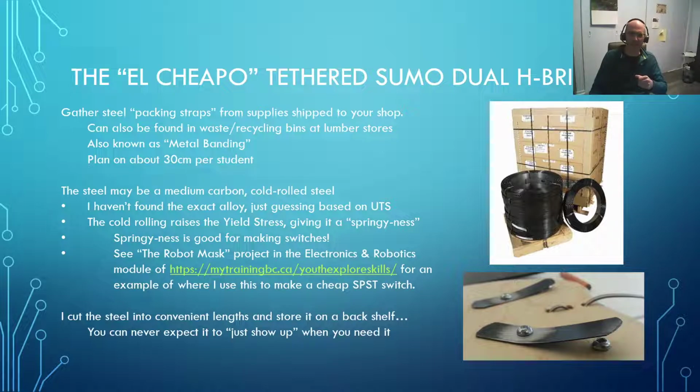So anyway, you'll notice a couple things on here. Of course, the strapping is painted to protect against corrosion. The painting also protects really well against low voltage signals like we're going to be running through it. So I've taken some time to sand this down right here, and of course sand it down on the underside here where it contacts into the other screw.